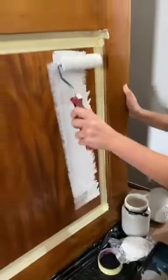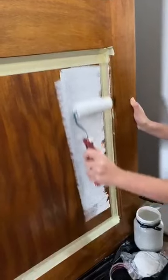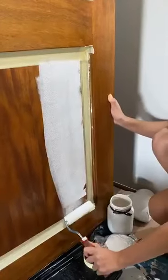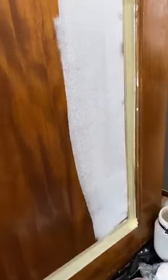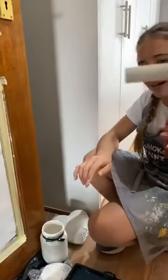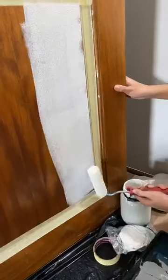It's okay if it makes blobs. If you're working with a foam roller, make sure that there is no breeze around you, as the air bubbles will pop and it will have a rough texture. As you can see, there are quite a lot of air bubbles, but that is okay — it is normal. You take your roller and go horizontally to get any stripes away, and the air bubbles will also disappear with time.